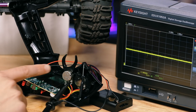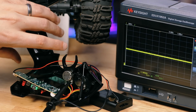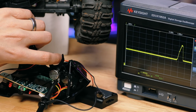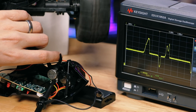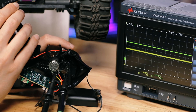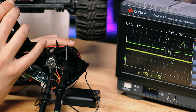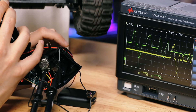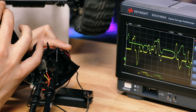After probing around for a while, I see that the throttle and the steering control are both controlled by a potentiometer. They actually look like guitar potentiometers, but if I hook up to that middle pin and change the throttle, we can actually watch the voltage change on the scope. So I got the steering probed in there too. There's a voltage applied across the potentiometer, and as the controls move, the resistance changes. This voltage change goes into an ADC in the chip and that gets translated into a control position — and what we can do is basically just control the line on these potentiometers.